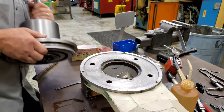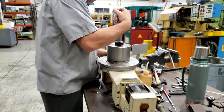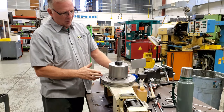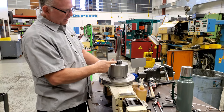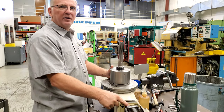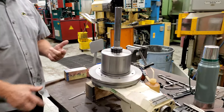If you take this up and put it like this, this physically drives the head. When everything is mounted, the backlash between the two bevel gears is eight ten-thousandths to twelve ten-thousandths. Any more than that and the hob will chatter.